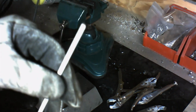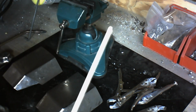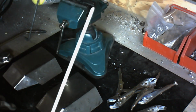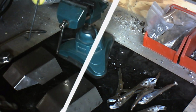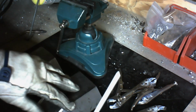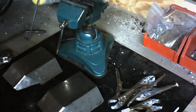They do require a little bit more heat to melt than the silver does, but since we're going steel to steel, it doesn't really matter. They also make aluminum brazing rods. They make all different types of brazing rods, but a bronze brazing rod is my favorite because it is stronger. I think it's rated for 60,000 psi. So once these are brazed together, they're not popping apart. It's going to take dropping the armor from a plane to get this stuff to break.